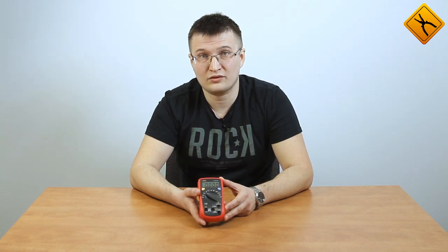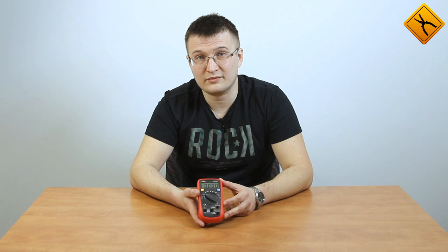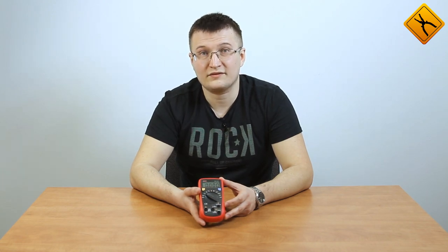Which is 4 times greater than the manufacturer's claimed range. Also I would like to mention a wide frequency range when measuring AC voltage — recommended values are from 40 Hz to 400 Hz, but we measured voltage with a 4 kHz frequency while the measurement variance did not exceed the one stated in the manual. UNI-T managed to create an amazing multimeter that has no competitors in its class. Needless to say, the UT136B is a great value for your money. Thanks for watching. Please subscribe to our channel and watch our other videos.